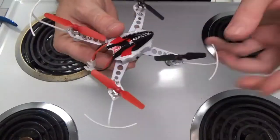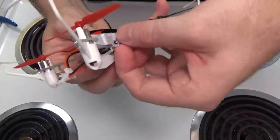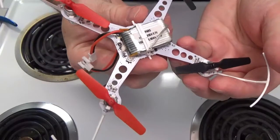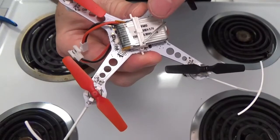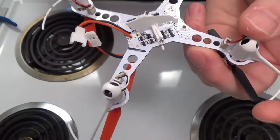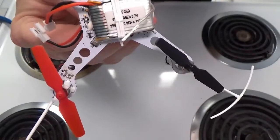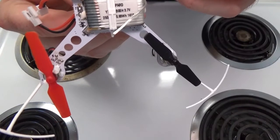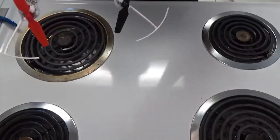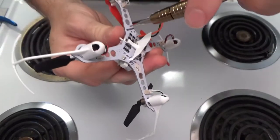The first thing you want to do is remove the canopy, which is very easy to do. You just slip these little rubber rings off the pegs. On the top of the quadcopter the battery is mounted using a little plastic frame, whereas on the bottom there's a little fin thing held together by plastic. We're going to disassemble the plastic bits and reverse the place of the battery — put the battery onto the underside, but keep the clip that holds the battery on the top, and that's what we're going to use to hold our FPV.